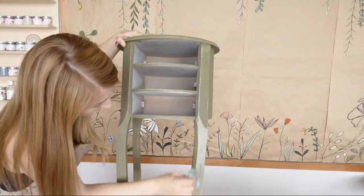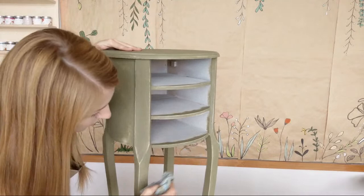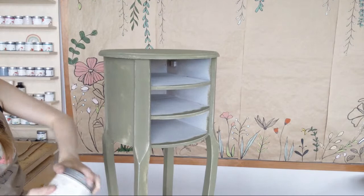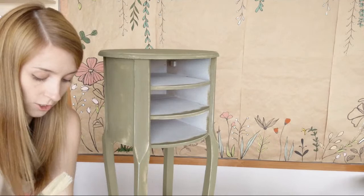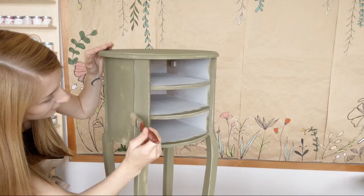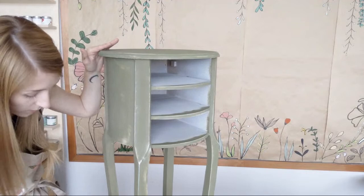It should be just a bit more distressed at the base. It's actually not bad with the bright teal peeking through — kind of interesting. I'm going to do just a little bit of dry brushing just to show you how to touch up. Barely putting any paint on the tip of the brush — just tap some excess out, then lightly brush up the edges. If you don't want to distress, you could also just do the dry brushing method alone. If you find there's too much contrast, go over again with your green mix.